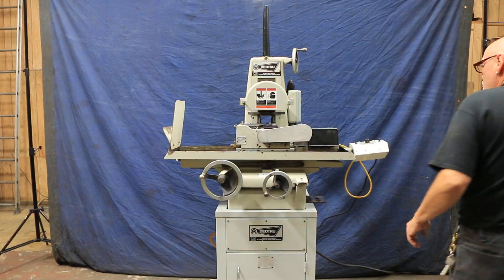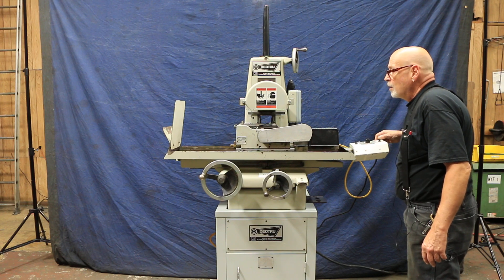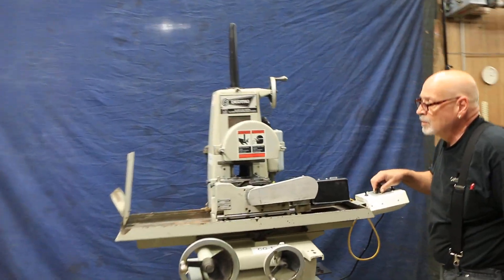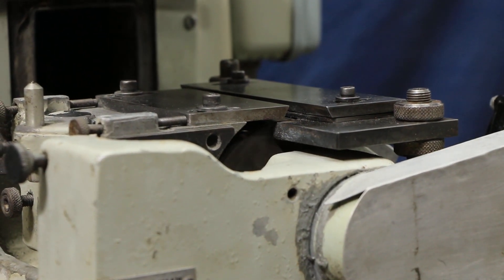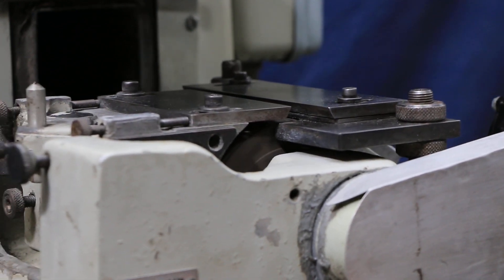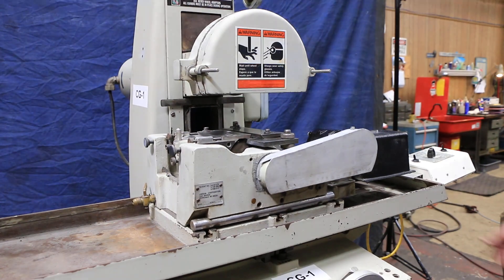This unit plugs into the back of the machine and has its own little power supply — you can go faster or slower. Right down inside there is a wheel turning that will rotate your part. You'd keep it straight and parallel if you don't want the part driving out the back; for a plunge grind you'd have a part that's only about an inch wide, come in underneath the wheel to the stop, grind it, and take it out.